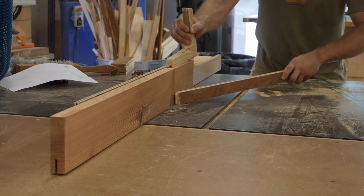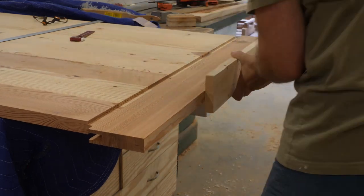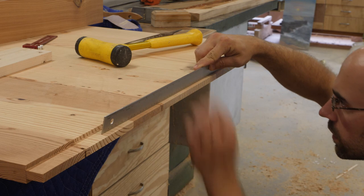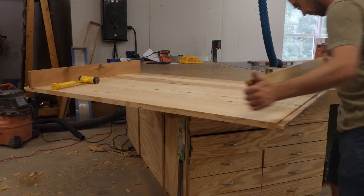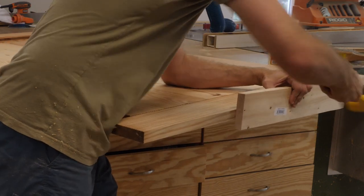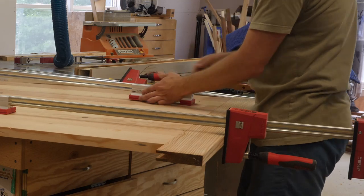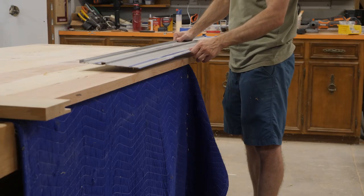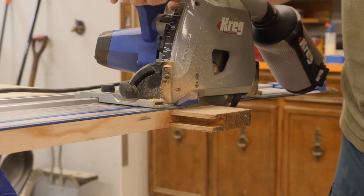Now with the table saw I'm cutting a groove in each breadboard. I'm using a flat grind ripping blade so that the bottom of the groove is flat — alternatively a router table could be used here instead. An important thing to notice is that the breadboard is longer than the table's width, which allows for easier removal while the fit is being tested. After a little refining of the tongue the breadboard is ready to be attached. To allow for seasonal wood movement it's important to only glue the middle third of the joint. These Bessey clamp extenders don't get used often but they sure save the day when gluing on these breadboards. With the glue cured I grab the plunge saw again and cut the breadboards flush with the side of the table top.